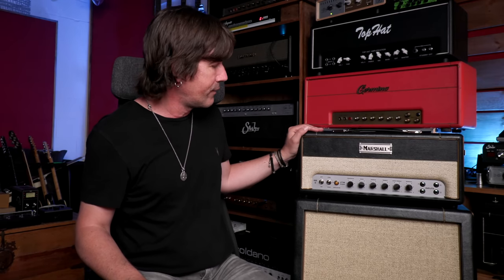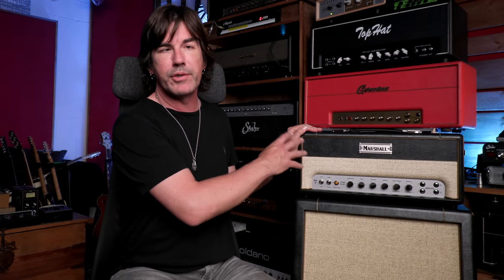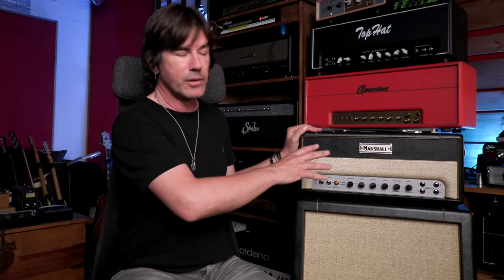So these amplifiers are really interesting. The JTM 45 sound is kind of like a bridge between Fender and Marshall. So this amp features a pair of 5881s. It doesn't have a tube rectifier. His big brother, the JTM 45 reissue, has a tube rectifier. I can only guess why they chose to not do a tube rectifier and do a regular solid state rectifier,